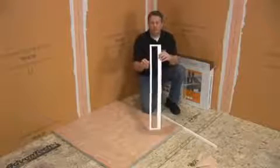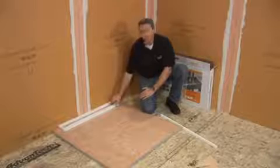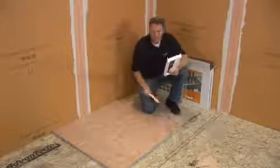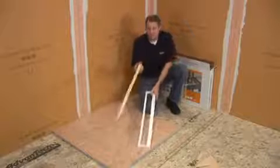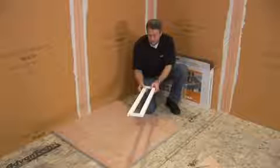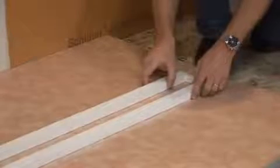You'll notice that the channel support is thinner on one side than the other to accommodate wall placement of our channel drain. This is an intermediate placement of the drain, so you'll find an additional piece of foam with the peel and stick strip. We'll use that to affix to the thin side, so now we're balanced out, ready to place it in the center here.